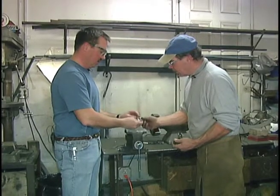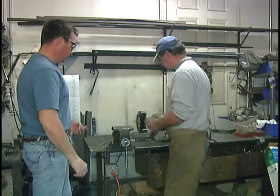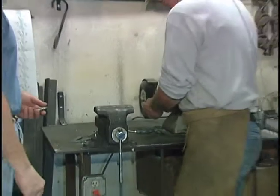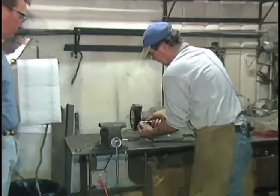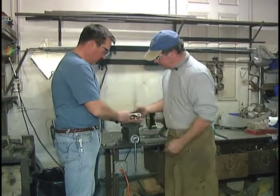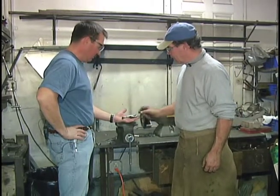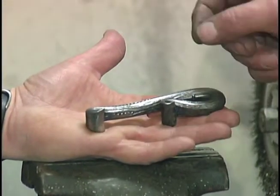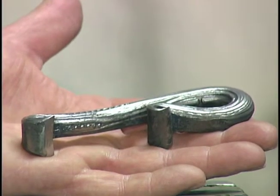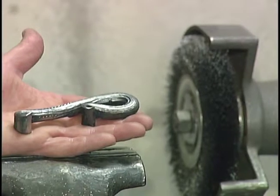Okay, this is a piece I see that you've been working on — you've polished a little bit, and when you're done with this one it'll look shiny like this. I'll polish it up and you'll really be able to see the texture. What is this? This is a wire wheel on a bench grinder. You can already see it comes up nice with the lights. The wire wheel really brings out the texture and the material. So we started with the black metal — what was the black on top? That's called mill scale. It's a material they put on there to keep the material from rusting, put on in the foundry to protect the material. Putting it in the fire and banging it does knock it off, and then this wire wheel really brings out the texture and shines it up.